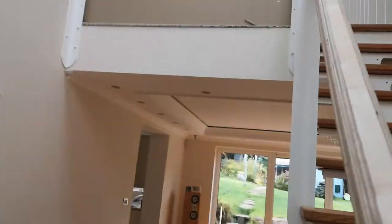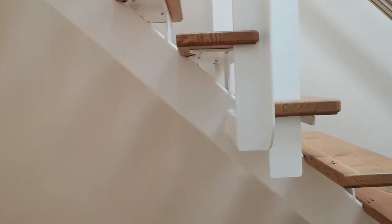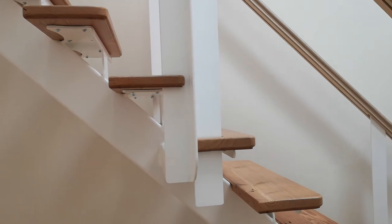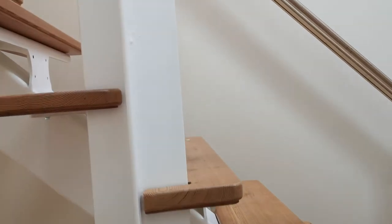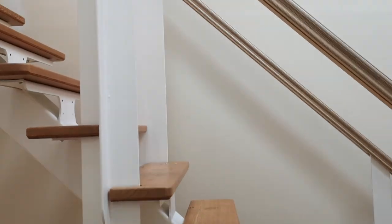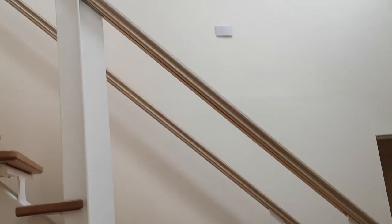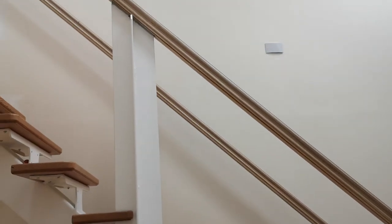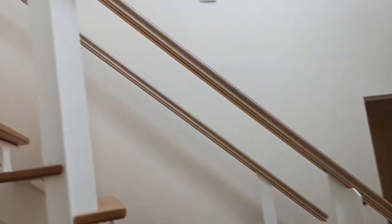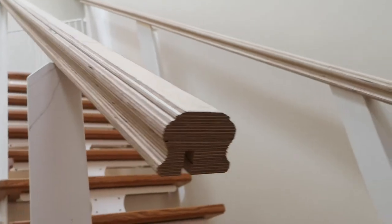One of the reasons I haven't got the balustrades yet is because there is a slight bit of movement — particularly when rushing down the stairs. If I bolt the acrylic to the steel and that movement happens, the acrylic is more than likely going to shatter or crack within the first week. So I need some sort of anti-vibration bush or engine mount type fitting, though obviously not to support anywhere near the weight of an engine compared to the acrylic balustrades.